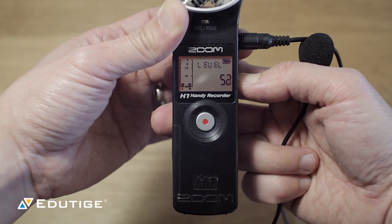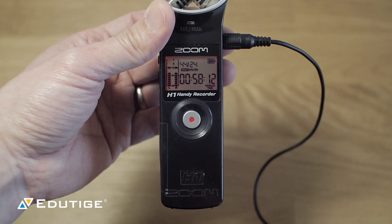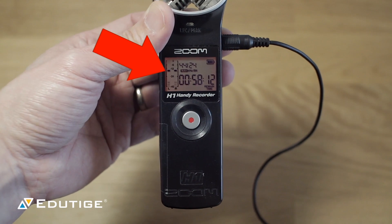The ETM-006 will actually increase the audio signal quite a bit, so you're going to set the audio levels to approximately 25 on the Zoom. Talk a little bit and see if you can get the levels to about minus 12 decibels.